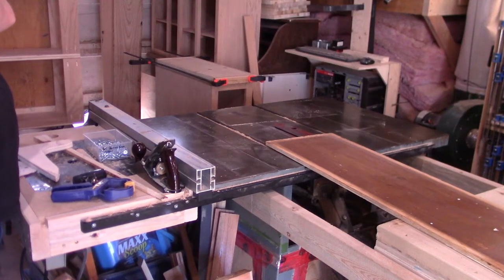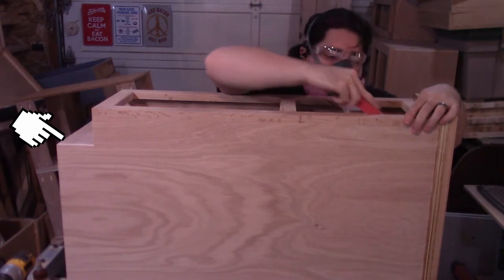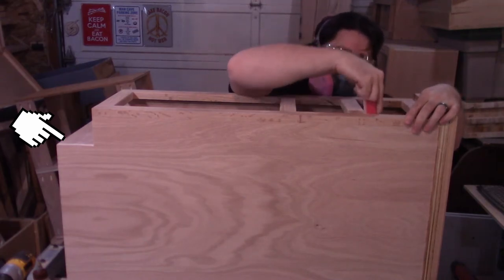At some point in this process, I realized I had cut the countertop about one inch too short. Currently it overhangs the face frame by about half an inch, but once I add the seven-eighths inch thick drawer fronts and door — yeah. To fix this off-camera, I just glued and pinned a chunk of oak to the back of the countertop to make up the length, and remounted the countertop. You can see it clamped up in the next shot. I'll just have to re-chamfer that corner. I also edge-banded the exposed plywood in the toe kick, but it doesn't look like I recorded that either.